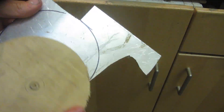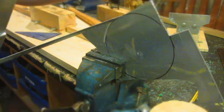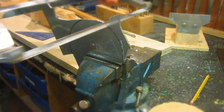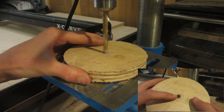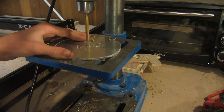I've traced the shape of the circle onto a sheet of three millimeter thick aluminium, which I'm going to use to stabilize the lathe chuck. I could have used my CNC but it would have taken quite a long time, and it's a bit annoying for viewers who don't have a CNC. So I'm just cutting it out with a simple hacksaw and files. Using a drill press I've drilled a seven millimeter hole right in the middle of both the plywood circle and the newly cut aluminium circle.